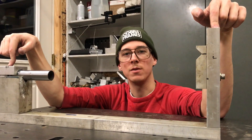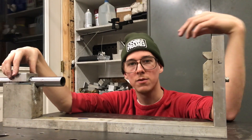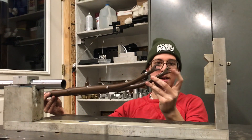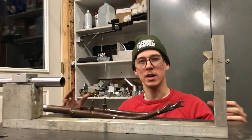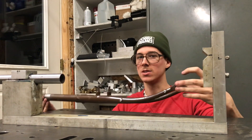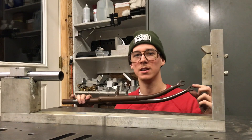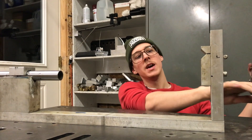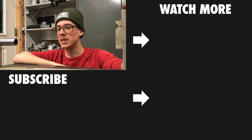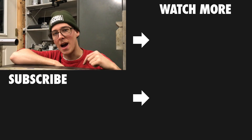This was a DIY project way before I had much machining know-how, made on somebody else's machine. For other people looking for DIY frame-building tool projects, this one's pretty accessible if you're making old-school forks with quick-release dropouts — it's just not as critical that everything be dead-nuts parallel and square. If you're making forks with through-axles it becomes a lot trickier, since you can't touch up the dropouts with a round file, so I'd consider buying a fixture from Anvil or Sputnik. Otherwise, it's a pretty approachable DIY project — hope you liked the video, hit that subscribe button, and we'll see you on the next one.